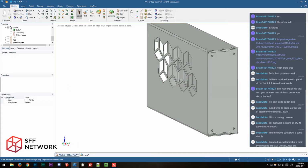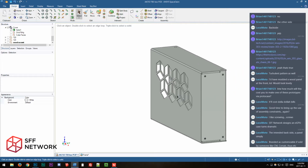Especially, I guess the most noticeable place you would run into a problem like that is if you have a hole, especially a fairly deep hole, and then you have a dowel or a shaft or something that's supposed to mate into it. If you didn't account for that and they're both exactly the right size in the metal, and then you paint both of them, then the only way you're going to get that part in there is if you take a hammer and scrape the paint off or something.